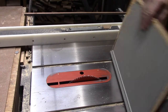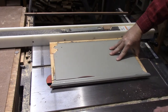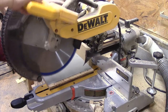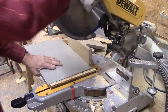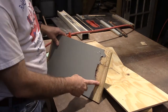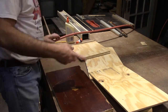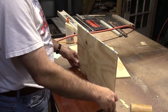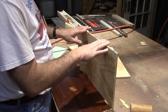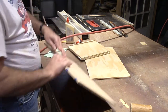I'm getting ready to cut the bottom. This is an old door off a cabinet that was salvaged, and I'm just going to use this for my bottom. Here's our bottom board. I actually cut one short so I had to rip another one real quick. Here are our cut sides: 19 and 5/8 inches is the length and 12 inches is the height. Now on one of them, I want to cut it down to 11 and a quarter — I'll show you why in a little bit.